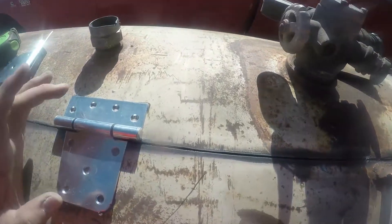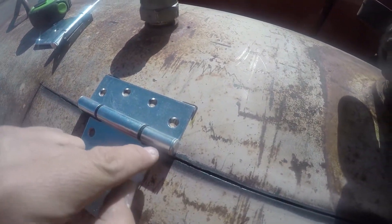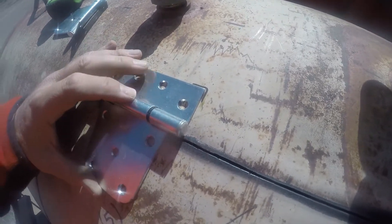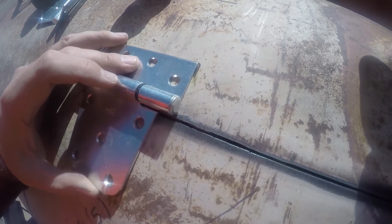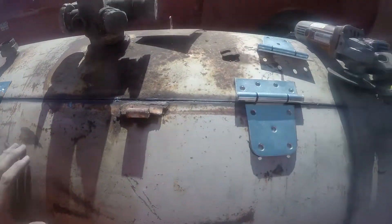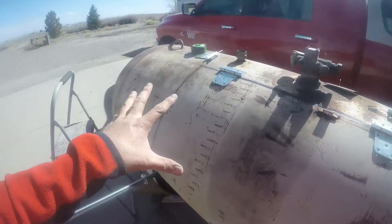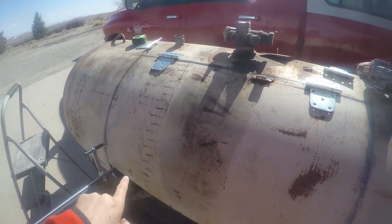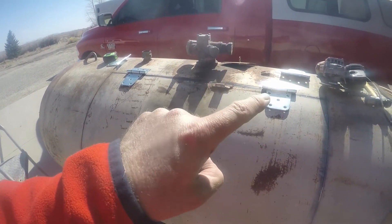Okay so that's my layout. I'm going to put the kerf right at the edge of this hinge, so the door should lift up around it like that. My original plan was to put the hinge centered, but I'll go ahead and put it like this. I'm really resisting my urge to pound this out and break it loose — I want to get these ground and hopefully tacked in so that I can then break it loose and open it that way.